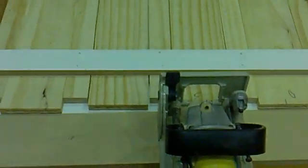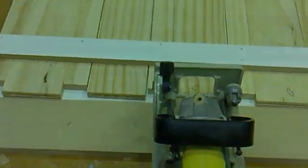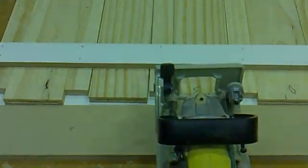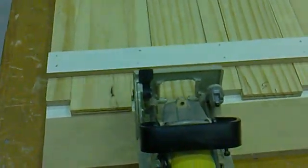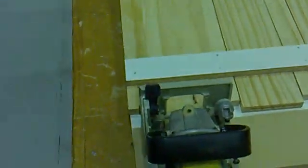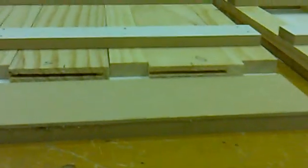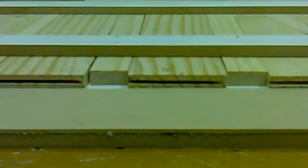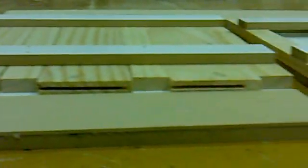Now, when you push it in, a blade comes out, and the blade creates a groove in the timber, so your biscuit can fit in there eventually. Same thing here. Push in, release. Push in, release. Now, what it's going to do is create these little grooves that you can see on the end of your timber. Now your biscuits fit in there quite nicely.